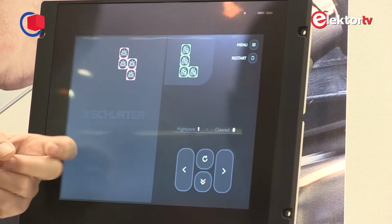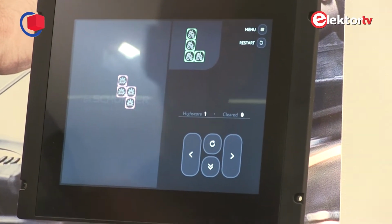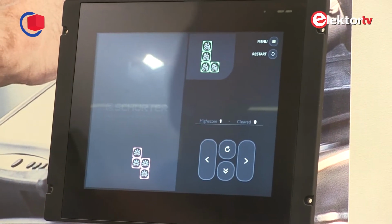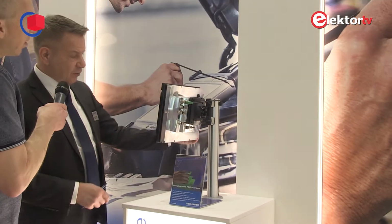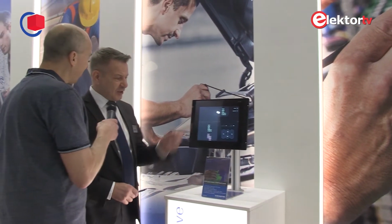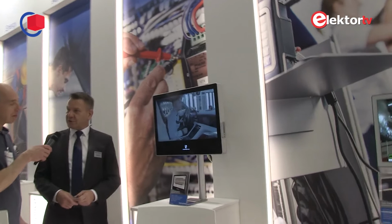It's also a chemically strengthened glass, 3 mm thick, so a high IK08 level, and anti-glare surface. Optical bonded display, so perfect. And finally, you see a rugged housing, closed, fanless. And then you play Tetris on it, I see. It's just for the customers. A very good example we made for a special customer in Germany for the e-car production.